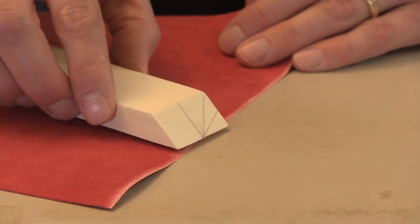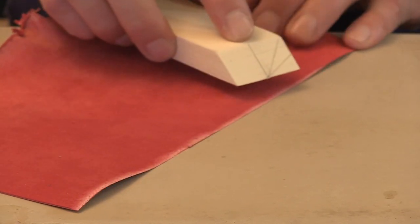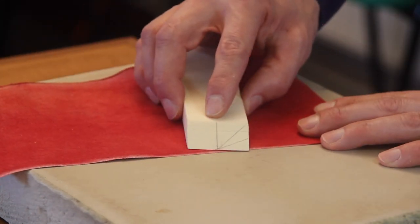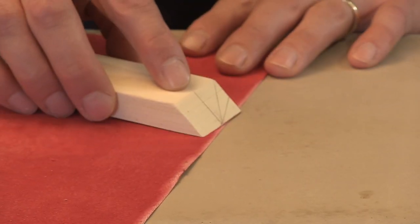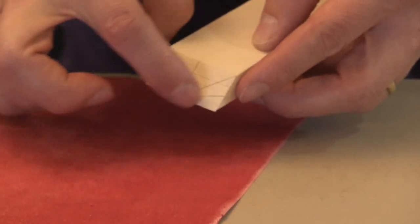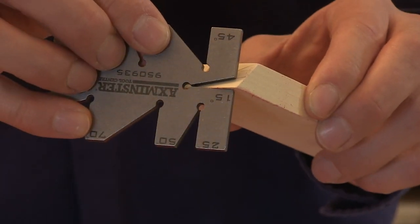If we come down further to a third angle — much closer to a normal approach — we would pare at this much shallower angle. The cross section would be nearer to 10 or 15 degrees, and life's a bit easier. The shallower, pointier blade makes cutting easier. So we've just looked at how skewing the blade gives the advantage of virtually lowering the angle.